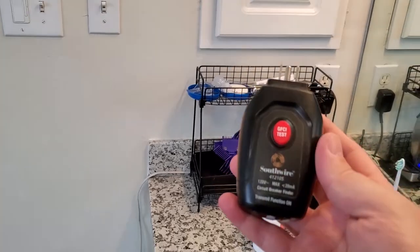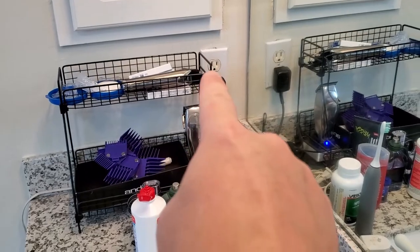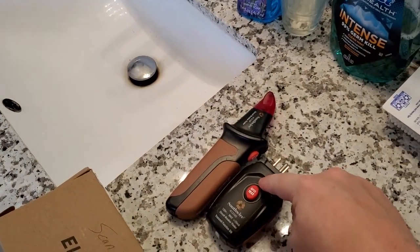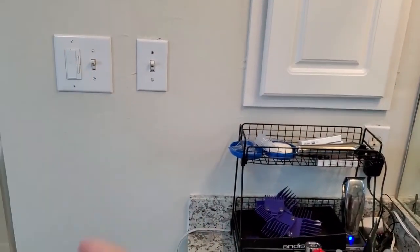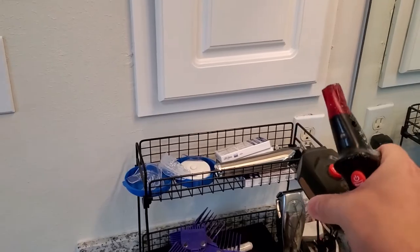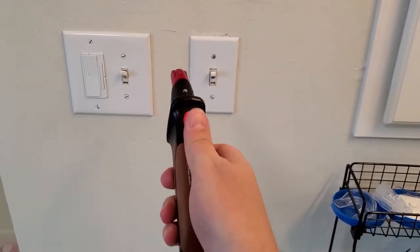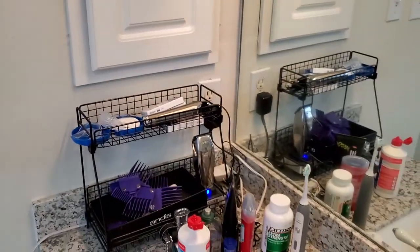This is a circuit detector. You plug it into a live outlet — it has to be live. It powers this transmitter up, which sends a chirp into the outlet, and you can detect it back at the breaker. In this case, I plugged the transmitter in and used the wand to see if this switch was on the same circuit. It was not — no wires were continuous.